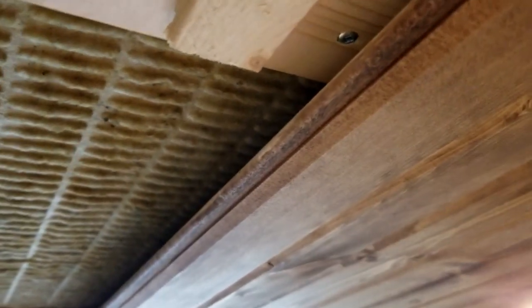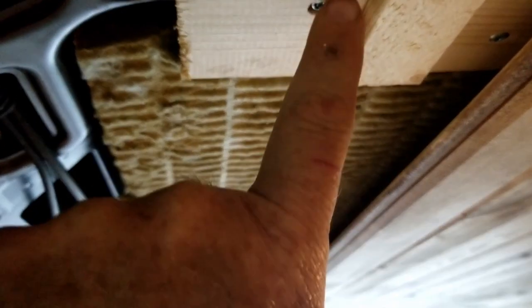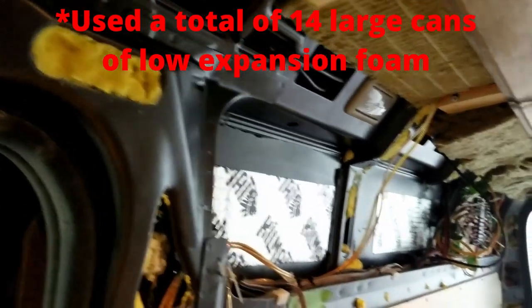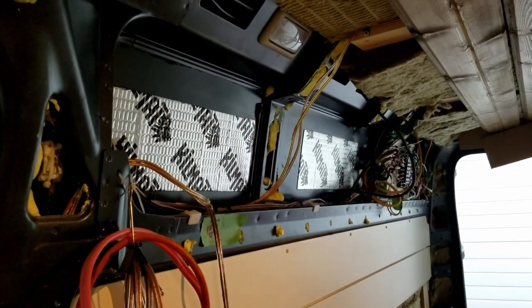In the kitchen area I've got quite a few more screws going into the beam that's going across. I go in here and here so it can't rock with just one center point. There's more underneath too for good contact. We're just starting to close it in - I've got two boards to put in here, and I realized I need foam insulation. I figure I need two to three more cans, which will bring me up to almost 12 cans total, along with about three bags of insulation.